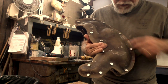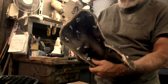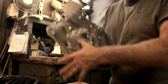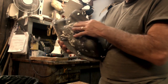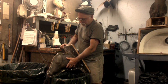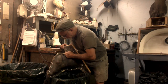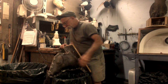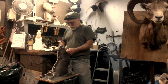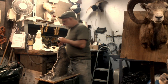See how I like to put the bolts all on one side — that's how that works. This one has the little pour hole and no flap, so you have to put your thumb over it, which worked really well last time. Now comes the tricky part: timing when to unmold. You don't want to wait too long because it won't come out easy, but if you go too soon it's still expanding. So let the foam cool down, then unbolt the mold.